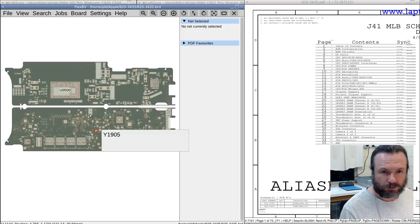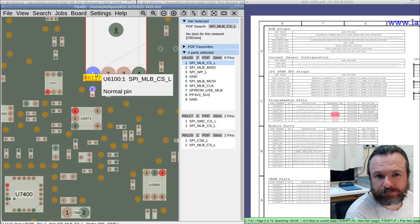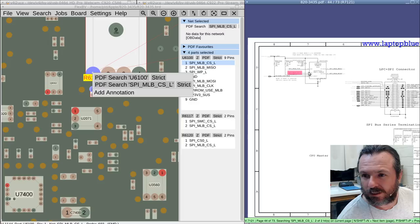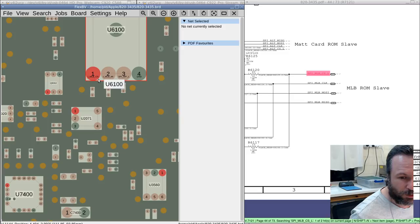Okay, BIOS. Yeah, okay, see, so that's an important pin. That's your SPI line, or one of them. So, without that working all the way through, it'll probably cause trouble. Let's see what else uses that. Okay, so the BIOS. So I have a feeling that the ROM chip's probably okay, but it needs the connections done properly on it to make it work again.